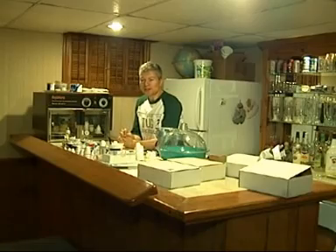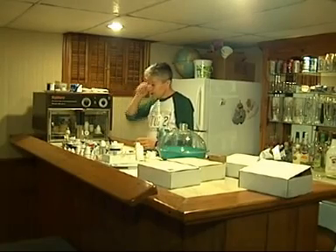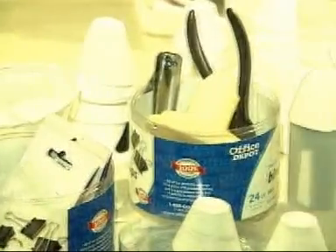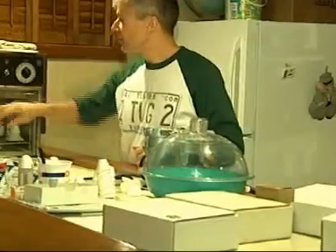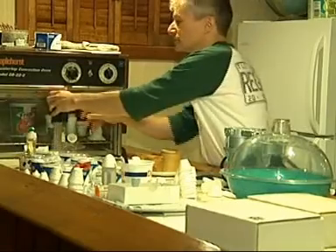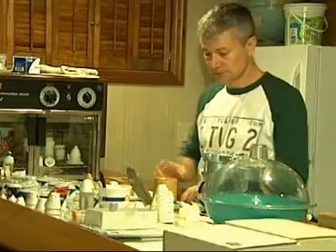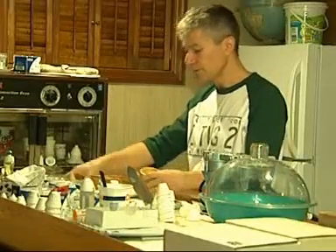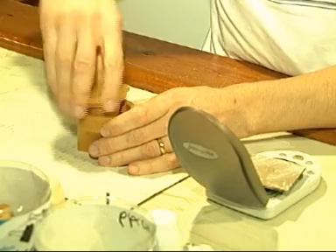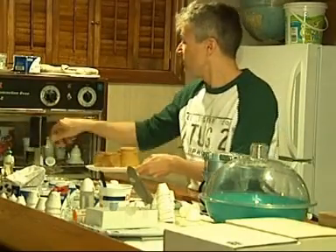We work with a food-grade silicone called Silastic, and it has to be cured in an oven, so I have a 200-degree bench oven and various components that I prepare in advance. The silicone has to be degassed before you can use it, so I have a vacuum pump and a vacuum chamber for that. To make these things, I take some molds, put the mold on the scale, set it to zero, add some silicone fresh out of the freezer, place the insert into the mold, and that's ready to go back in the oven at 200 degrees for 20 minutes.